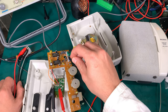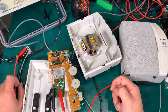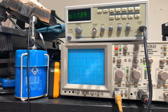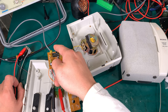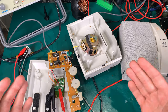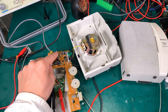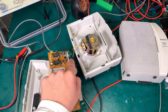The socket was routing the input signal incorrectly. I cleaned it with isopropyl alcohol, plugged and unplugged it a couple of times, and it started working again. I connected the probes at the input of the amplifier and got a signal. I checked the function generator on top and oscilloscope on bottom — the sine signal looked exactly the same on both sides. I put the TDA back and it didn't work — because the TDA was also blown. Same channel had a blown TDA.